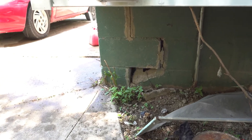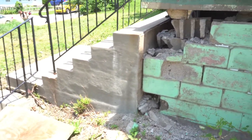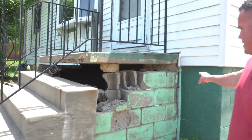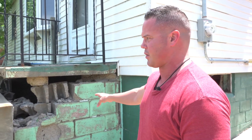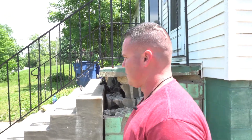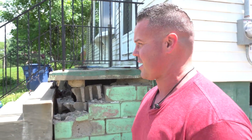You can see down here the massive foundation damage. We have this issue with the front stoop — it's leaning and kind of falling down, but the big chunk of concrete and the rails are actually in good condition. We're probably going to have to replace this wall, which is the one we didn't think we'd have to replace. We're hoping the foundation contractor can rebuild the block along with it so that we don't have to mess with the stoop — they'll actually mud jack it up and level it all out. The grass in here was about three feet high, so they had to get weed eaters out to do it.